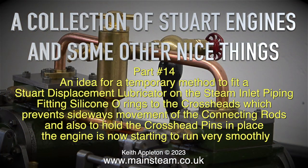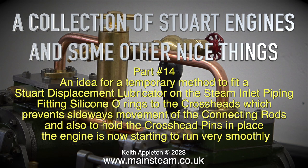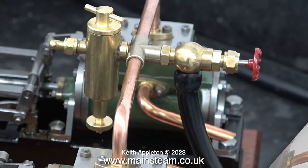This is part 14, an idea for a temporary method to fit a Stuart displacement lubricator on the steam inlet piping. Fitting silicone O-rings to the crossheads, which prevents sideways movement of the connecting rods, and also holds the crosshead pins in place. The engine is now starting to run very smoothly. I must stress that this is a temporary method of mounting a displacement lubricator.